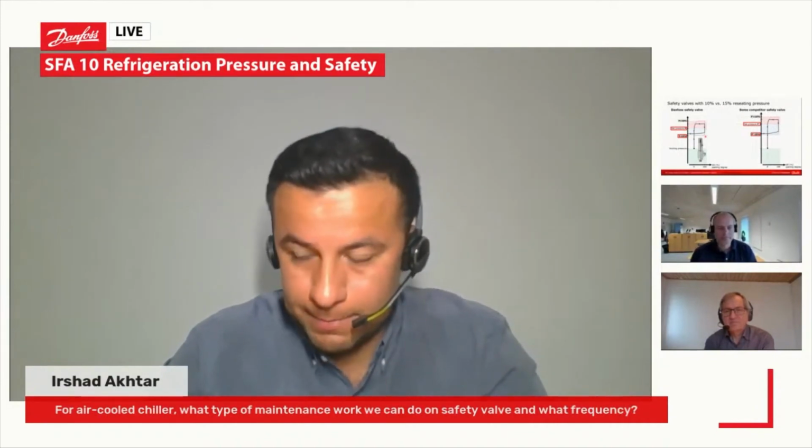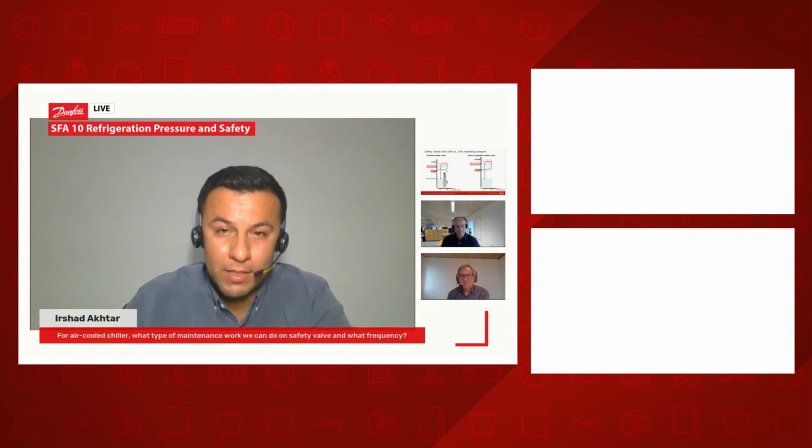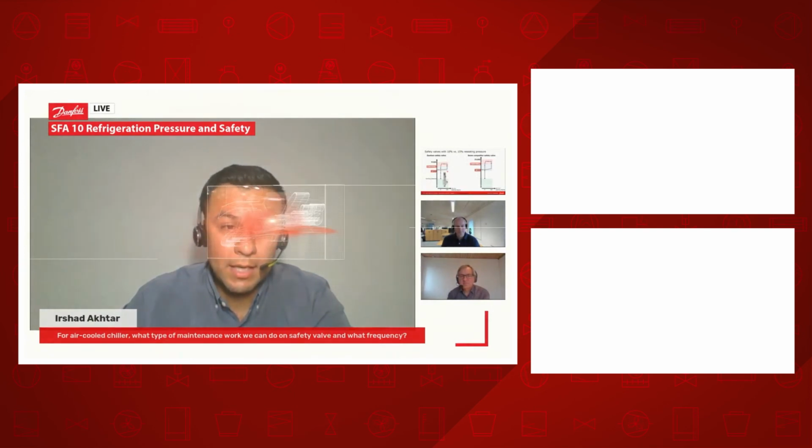Well, I would say that the requirement when it comes to safety valves will be similar for different types of refrigerant systems. Depending on the country, there is usually a requirement on how frequently safety valves have to be inspected, and on how frequently they need to be calibrated. In general, that requirement will not exceed a 5-year period. So from that perspective, at minimum, safety valves should be calibrated within 5 years.